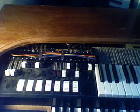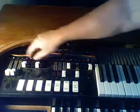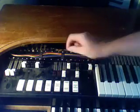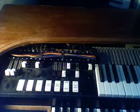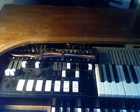This is important because we don't want the whole assembly to come apart on us right now. These four sets of bolts with a hex head and washers below them are what hold the assembly in place. We're going to take those out first. Do not take out these small screws that line it — those hold the connectors that keep the busbars up against the top of the assembly, and you don't want to remove those.